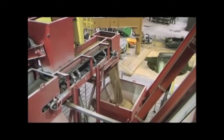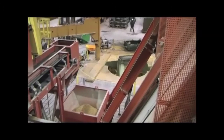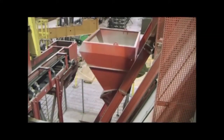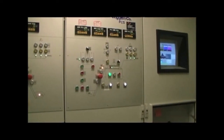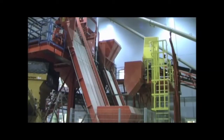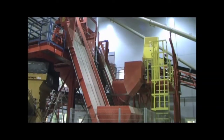Meanwhile, sand, stone, cement and water are mixed in computer-controlled batching equipment. The aggregate and cement are properly weighed and just enough water to hydrate the cement is added to make a zero slump concrete that is perfect for dry cast pipe production.